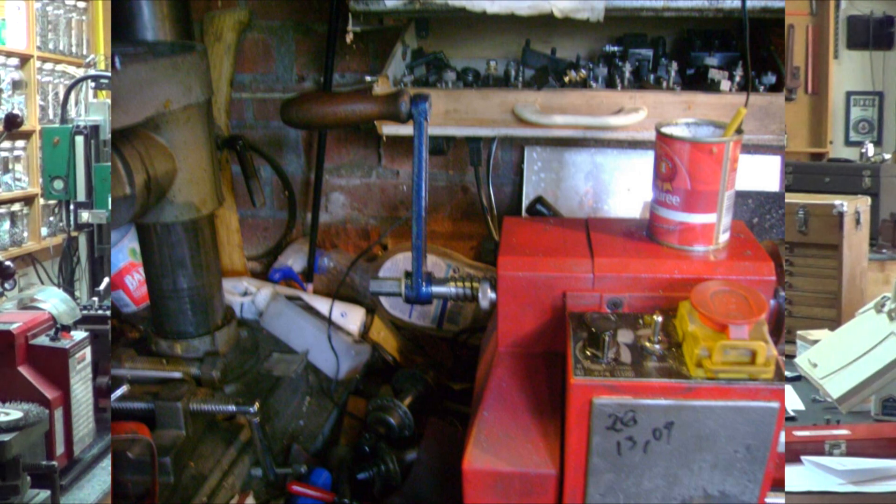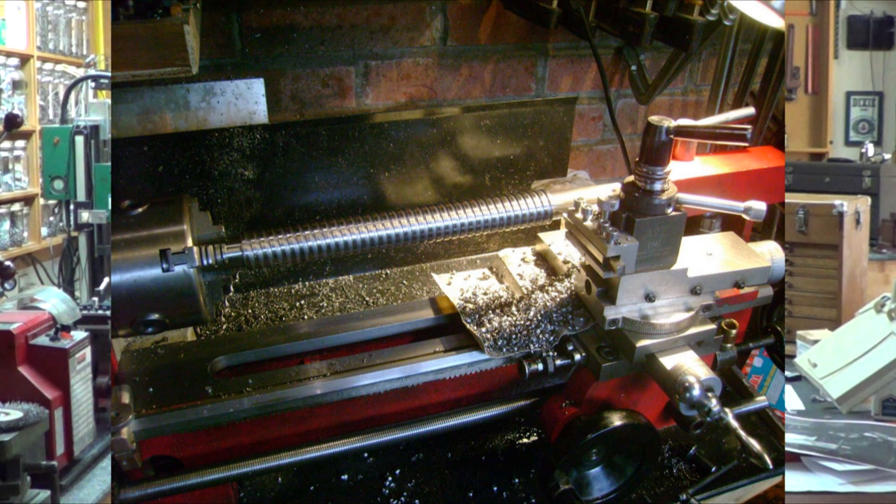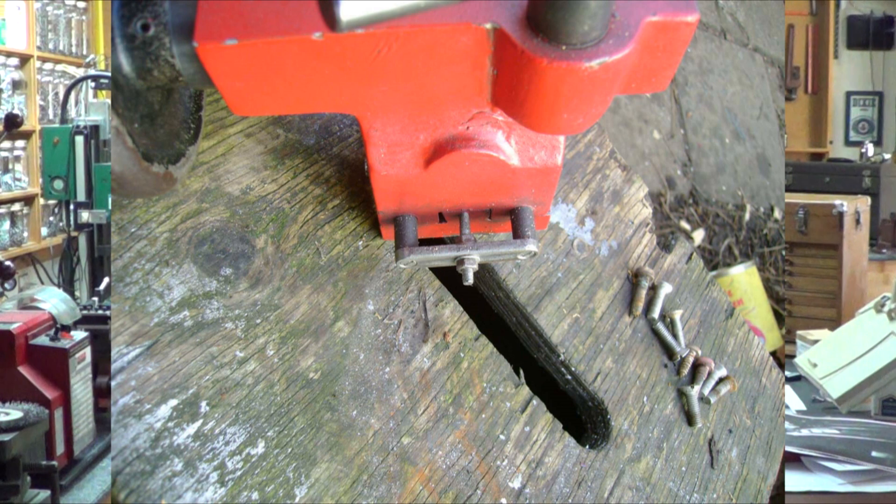The next picture is some of his work — that is an incredible picture. He is doing fantastic, clean-looking work. He also did something to the tool holder for height adjustment — looks like he made his own permanent one with a set screw in it to hold it to the right height so it doesn't move. But the next picture is the one that really counts. This is what he did for adjustments: he put a plate in there with a nut on each side, which allows him to fine-tune it back and forth to get it dead center.